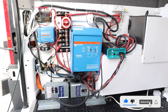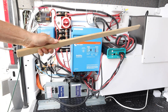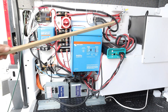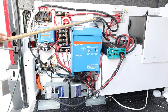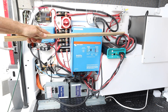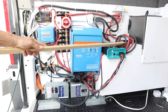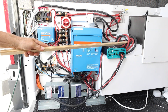Explaining this step by step, I'm going to go from the battery. Over here we have two 202 amp-hour lithium batteries from Big Battery. Those go into a bus here and a bus here. They are connected with Anderson connectors — two Anderson connectors — and there's enough cable that makes it easy to pull them out and work on them. This cable is exactly the same length, both the negative and positive.